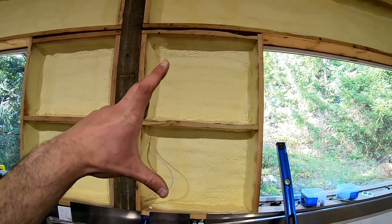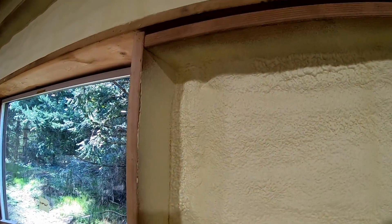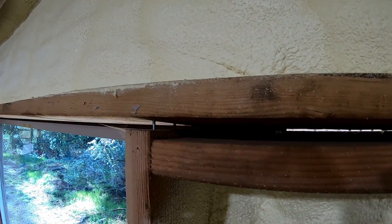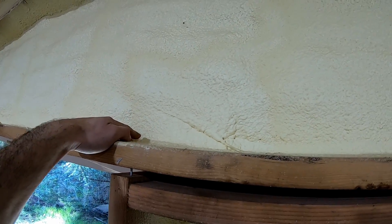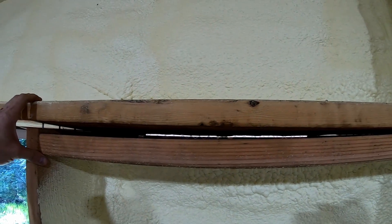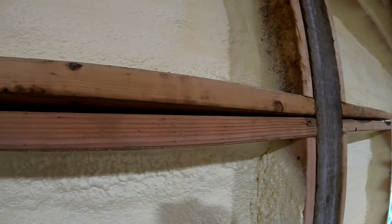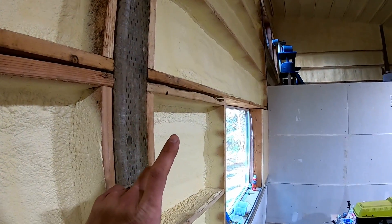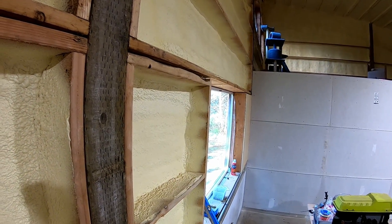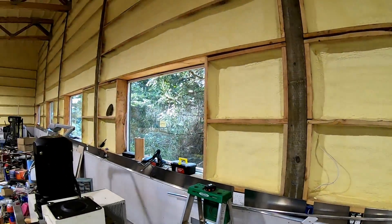When you come and look really close, this is nominally a four-foot spacing, so you should be able to stick up a sheet of plywood here. But when I installed the next sheet up here — which I've since pulled down — I realized it wasn't that easy. We've got these two boards that were nailed together and they've pulled apart. I'm not sure how they pulled apart. Maybe the boards cupped and twisted a bit. You can see light from the outside in between these two boards, which I'm not sure how that happens given there's sheathing on the outside. We've got like a one-inch gap up here, which means I'm not sure how I'm going to fit a four-foot sheet. I'm going to have to do lots of cutting and trimming, and may have to install more girts and backer pieces, which is frustrating.